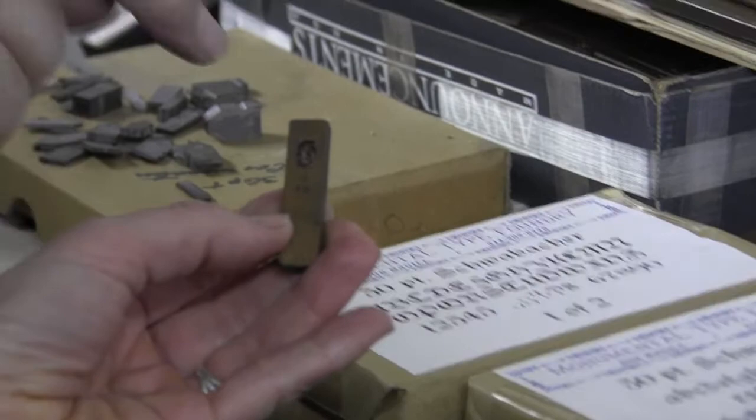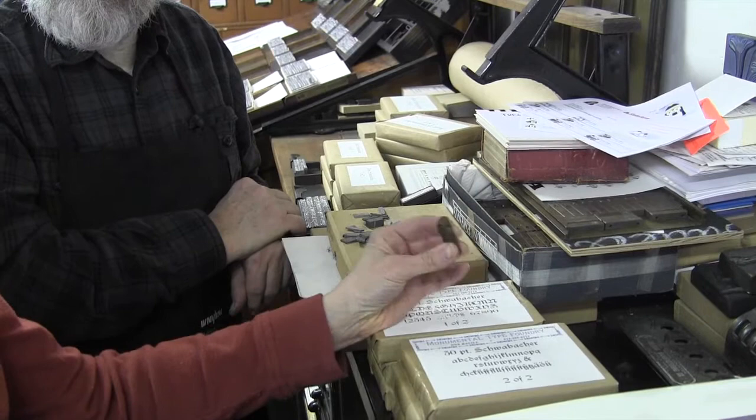The copper isn't hot. It's smashed in there. That's a lot of pressure. Well, they've got presses that press them both together. But that was the way that they did it at the beginning. It was not mold making. It was not casting. They engraved a steel punch, and they hardened it, and then this is copper. It's not brass. It's copper, but it's pretty soft. And so they're able to drive that steel punch down into here to make the individual mat.